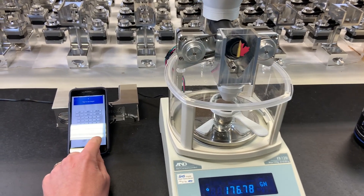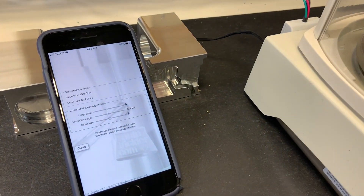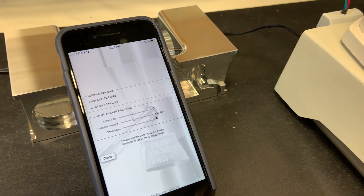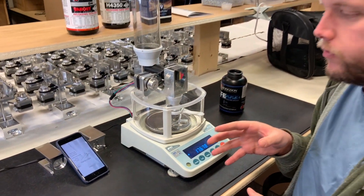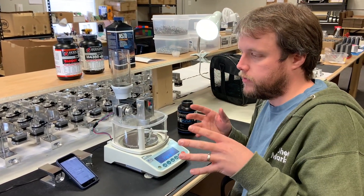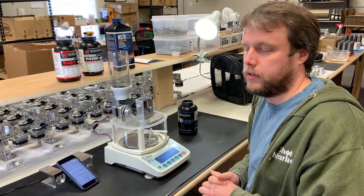We're looking for a flow rate between 0.1 and 0.2. The manual explains that you want a flow rate in that range. If the flow rate is too low, then the powder is probably not flowing very smoothly and there's probably going to be gaps in the flow. And if the flow rate is too high, then there's going to be too much powder in the tube, and even if the motors run slow, it's going to be hard to drop just a couple of kernels at the very end.